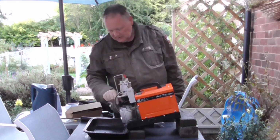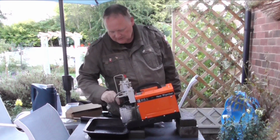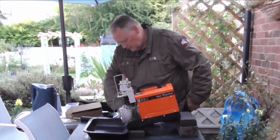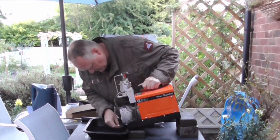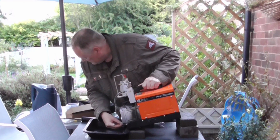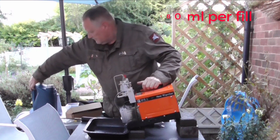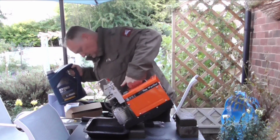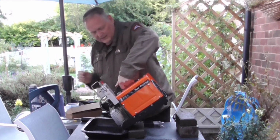So all I need to do is basically release the plug on top, the breather, and then just undo the actual nut at the bottom, the bleed nut. I'm using an old baking tray to put the oil in, but it don't take much oil anyway. The actual oil that I've got, it's compressor oil. It's the Hydro ISO 46, which is recommended. So I'll just drain that now.